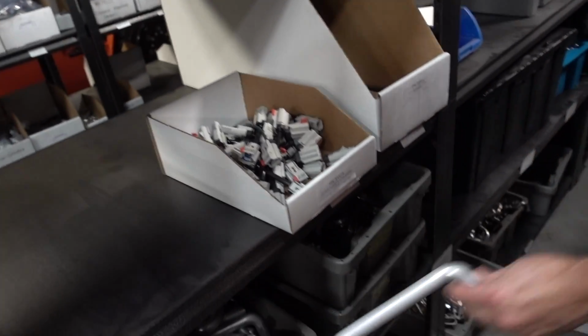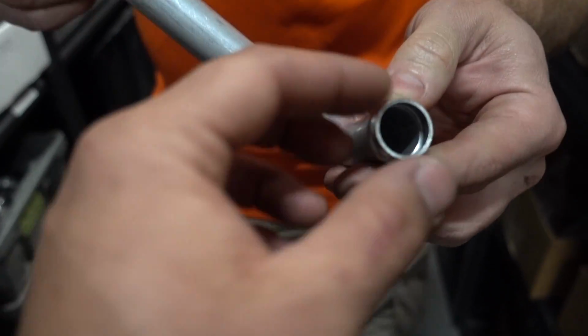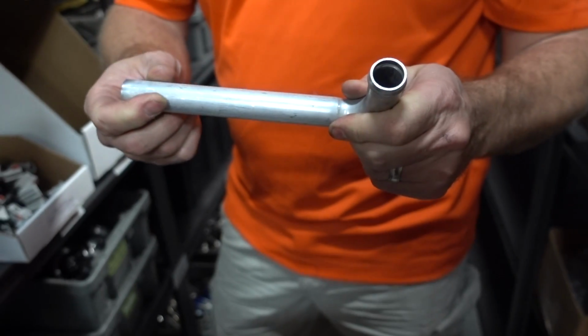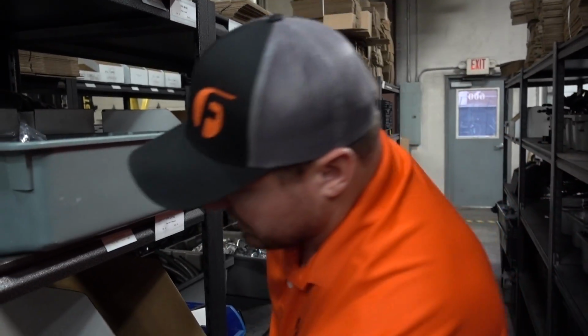These, we've got a CNC tube bender. We make these. We do the bead roll. Yeah, with the bead roll. Anybody could probably give you a 90-degree pipe, but if you know the little details. Yep, a real tight bend like that too, for our turbocharger drains. Then we make the turbocharger drain fitting. There'll be some finished assemblies over here.